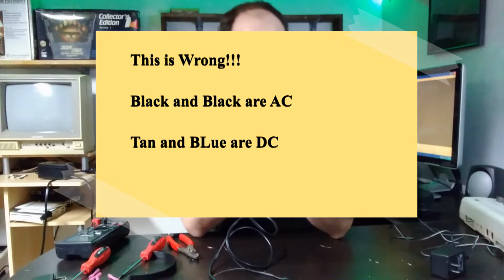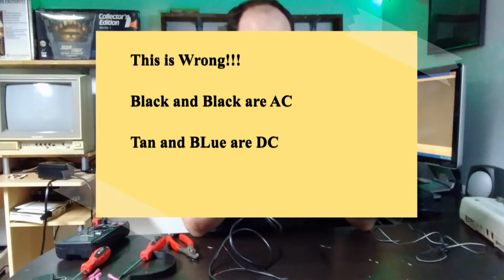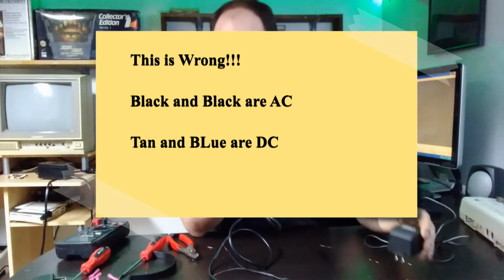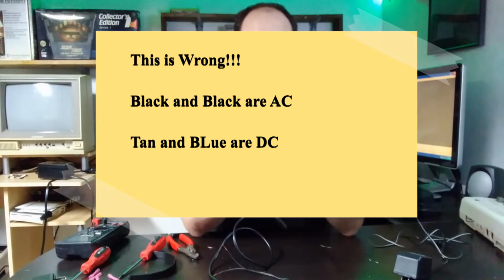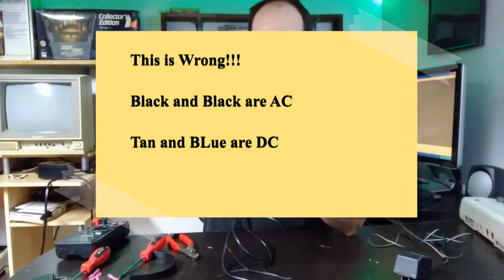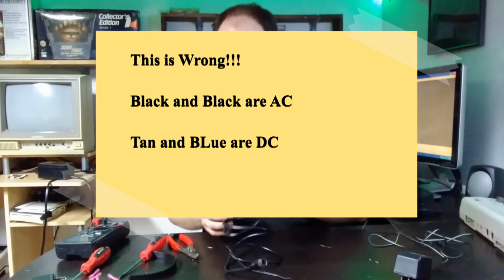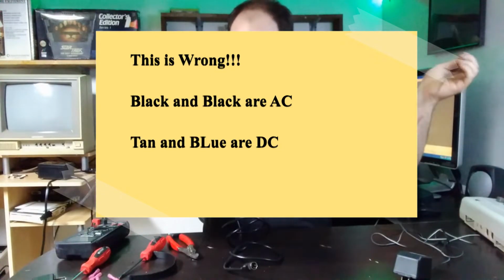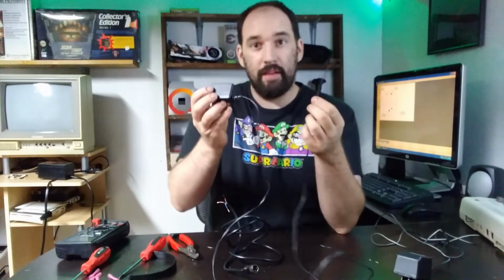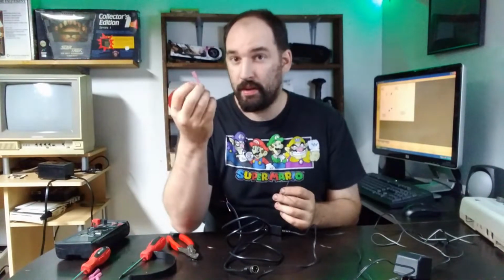Now from what I can tell, I do not believe that the AC one is polarized. But the 5-volt DC is polarity sensitive. So black has to go to ground or DC negative, and tan is DC plus. So I've actually plugged this one in and very carefully figured out its polarity. So we're going to splice these together using these butt connectors.